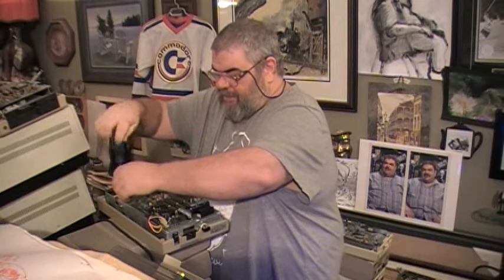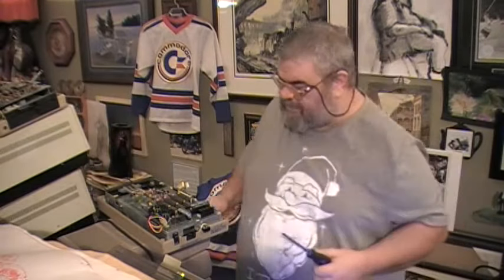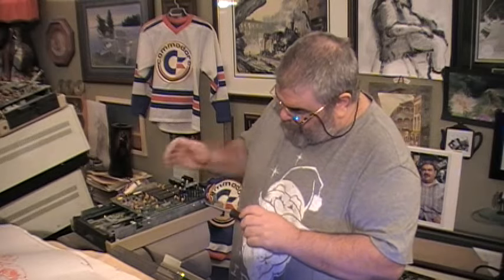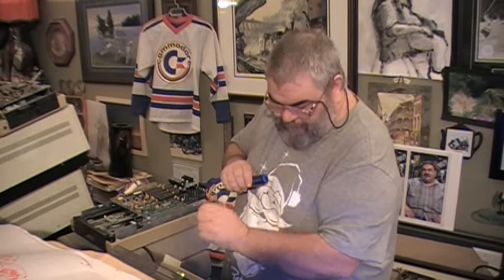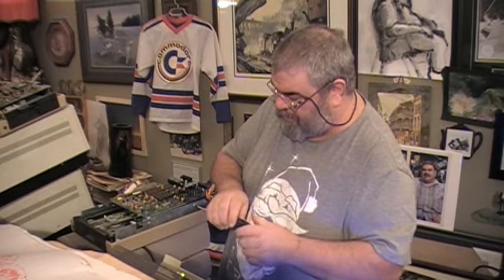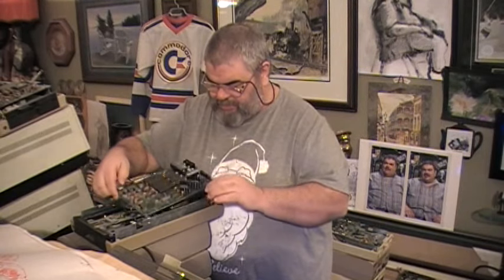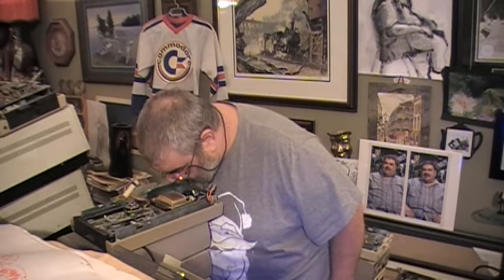Well, this is an interesting moment in time. It may be you actually have a drive mechanism that is bad. Or could have worse. As it happens, this drive has all the chips in sockets. So if this board works on another drive, it might be a very welcome thing, to make one of the other drives that does not have a working board work. But I suspect we might have a better idea once I get the board off of here, we'll see if there's any signs of the power supply cooking. And it seems to be okay.